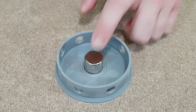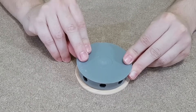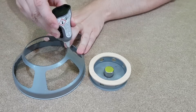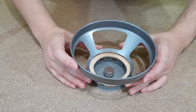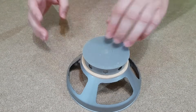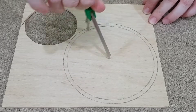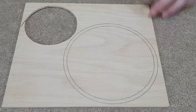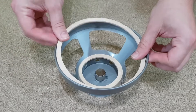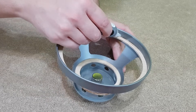In this video I will use a lot of super glue. The speaker driver is made from many components of different materials and the glue needs to dry really fast. Once I put super glue on a component and place it in position it cannot be moved anymore, so I need to be careful to place each component in the correct position from the first time. Another plywood ring will be used to make the speaker frame stronger and to help glue the surround later.